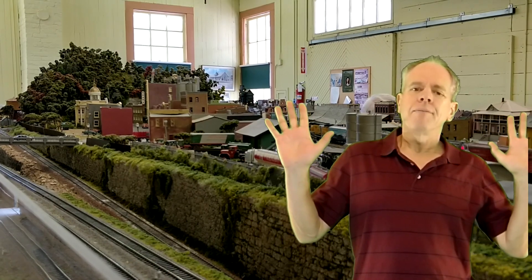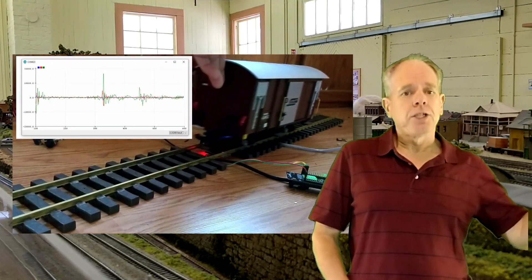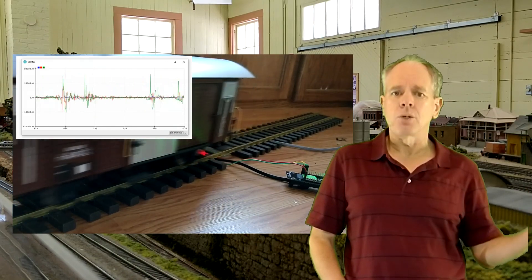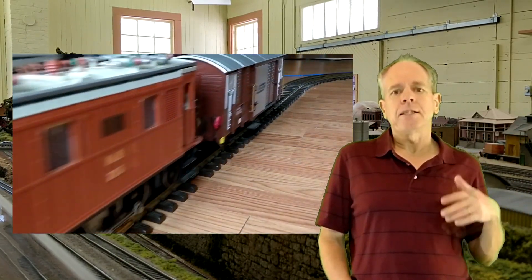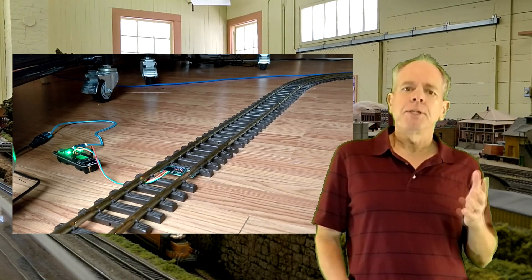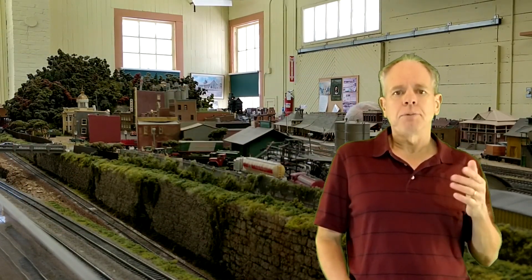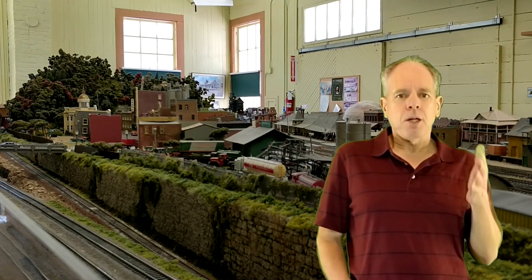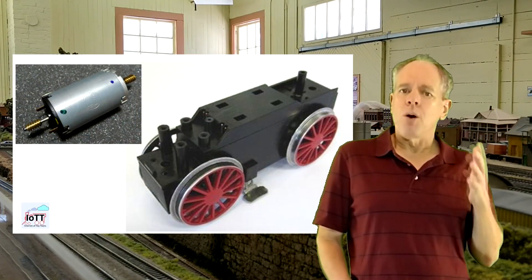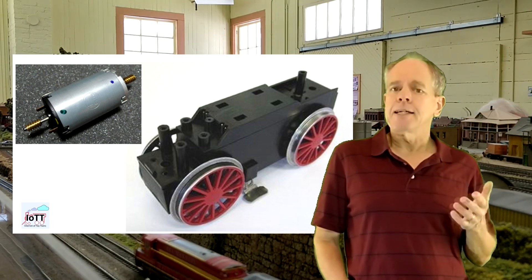Well, not so fast. What I forgot was that I was doing these investigations in a lab situation — straight track on flat and hard ground, just one car manually pushed with one or at most two axles crossing the groove. As soon as I integrated my sensor in a track oval and added a locomotive, things looked very different. The amplitude-based trigger was still working, but the other signals no longer provided the clear information I had before. There were two reasons: first, there was much more noise in the signal as soon as the locomotive was added — the source being the motor itself, wheel wobbling, and gear vibration.